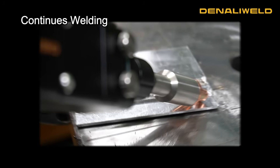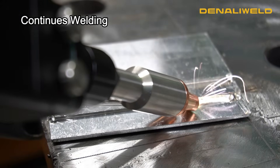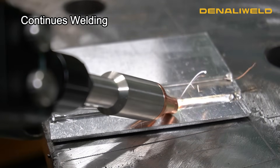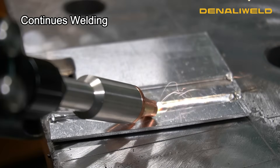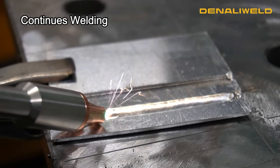That spacing will also change based on your wire feed speed. Once you get into playing with the wobble frequency, that'll also make a difference in the way the scale weld feature actually works on the material. Here we're showing you the comparison between a straight stringer with the laser welder and then the scale welding feature to lay down a stack of dimes.